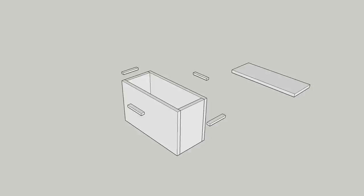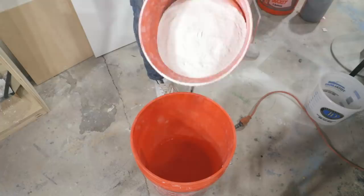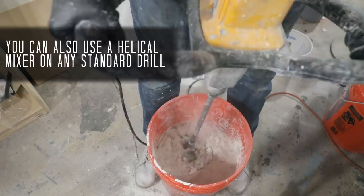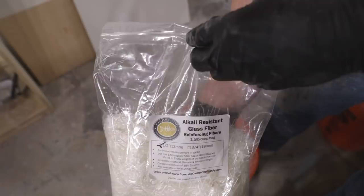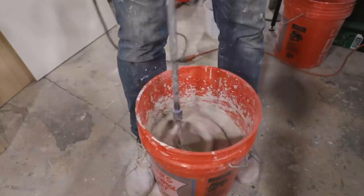It's time to mix up the concrete. For this project, I'm going to use some glass fiber reinforced concrete mix, or GFRC mix for short. The mix I used was from Fishstone. You can make this with any bagged concrete mix from a big box store; however, using GFRC allows me to make the planter thinner — I had one inch thick walls. If you use another type of concrete, reduce the size of the inner form so the resulting concrete walls will be at least an inch and a half thick. The Fishstone GFRC mix is naturally white, and I wanted a gray planter, so I added a bit of black pigment to the mix.